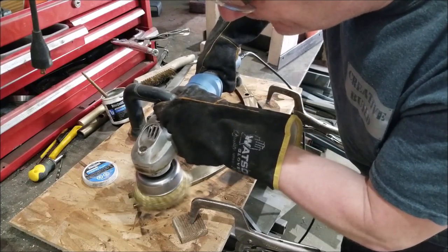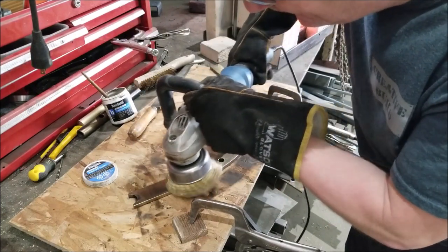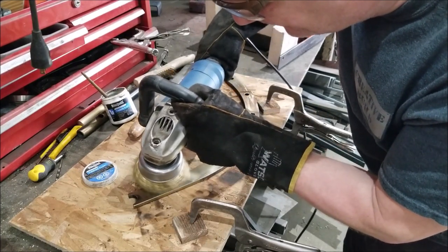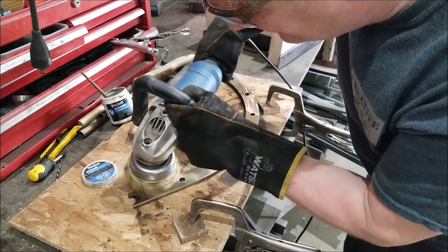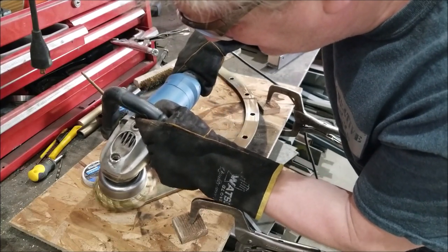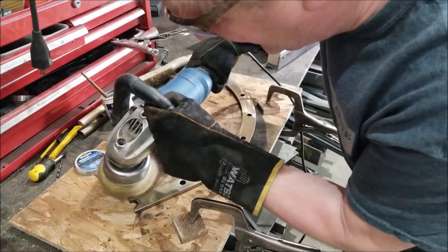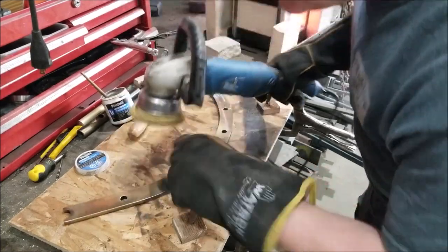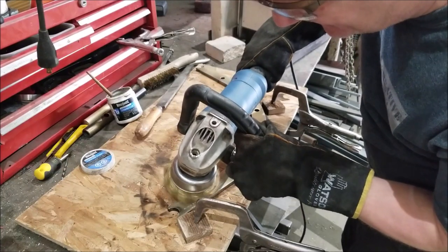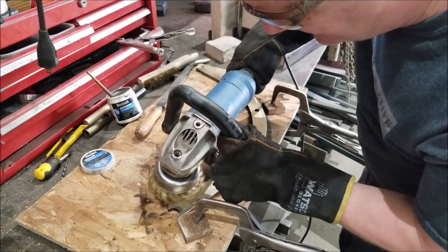See how it's actually not taking right now, and then if you watch closely, there's just the moment right then where suddenly it's being applied like magic. You can really feel it grab when the brass is at the melting point. There's a lot more friction.